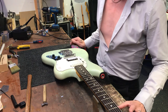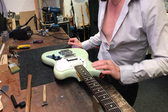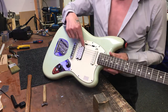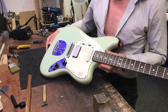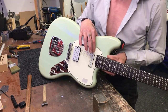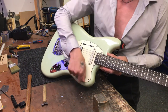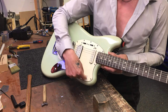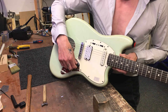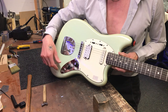Like Ryan's other personal instruments, we gut it and have the single humbucker only go into volume and tone. The face switches with the neck single coil Jaguar-style have been disconnected, and the kill switch — just a two-way cut-off switch — we took out and disconnected as well. So it's a straight humbucker to volume and to tone. I did suggest just taking it straight to volume and forgetting the tone, but whatever.